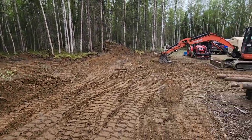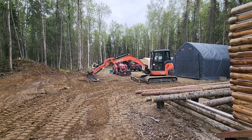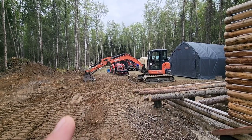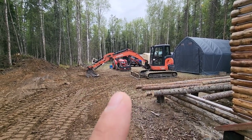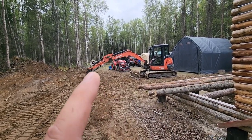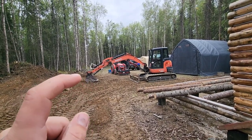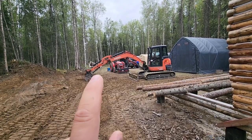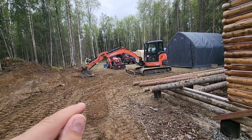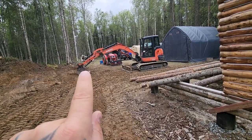So you guys can see, there you go. One more little fun fact. Probably if anybody's been watching the last couple days, I don't know if you noticed this, the way I park the excavator like this. I park it like this every time, and there's a reason for it. It's not just because it needs to stretch. No, it's because there are grease zerks that you have to have the bucket angled just so to reach off the backside. And the bottom of the ram for the thumb right here, if the thumb isn't pushed down some like that, you can't get in at that zerk there.